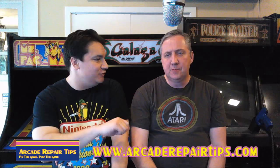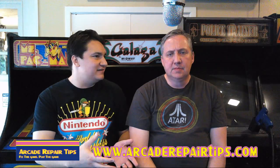Now, Tim, I've heard of people who will remove the horizontal width coil and use an Allen wrench to unjam it, once they've tried to spray some silicone or some WD-40 in there or something like that. But don't do it with the monitor on. Right. TV alignment tools are what they're made for. Exactly. So Tim, any suggestions on why his horizontal width coil may not be able to be adjusted, or on the chiclet capacitors?